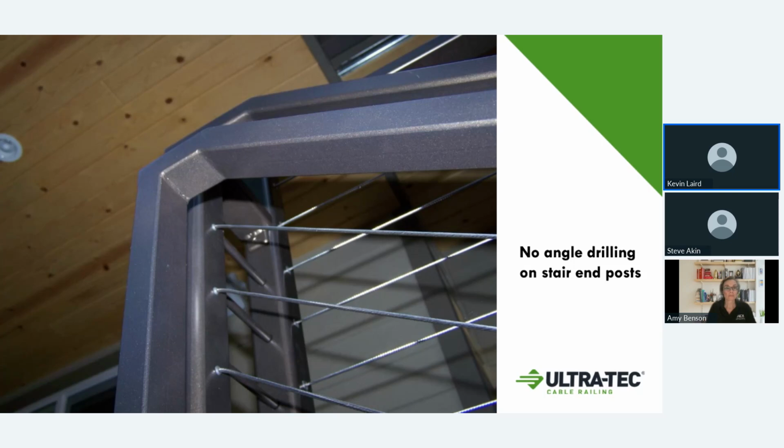You also want to design it with a double end post, corner post. Instead of using a single post in the corner, you can do that, but because you can't have a hole running at the same level in both directions, that will not allow you to use a fitting in both directions. So your only option is to offset your cables, which sometimes doesn't work well, or use a fitting that goes through the post on one side, and then one that actually screws into the outside of the post or the inside wall of the post in the opposite direction. Those inside mount fittings are a little more expensive. So you'll save money by using a double corner post because of the savings in cost in your fittings if you set it up that way.